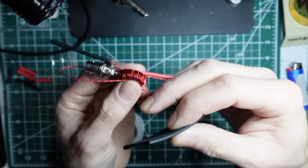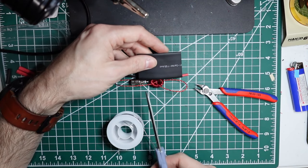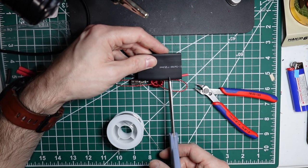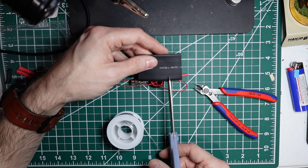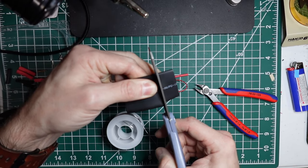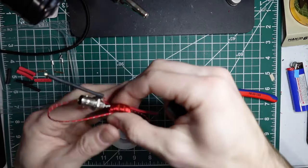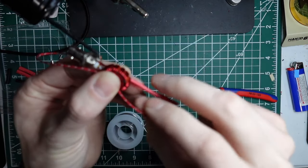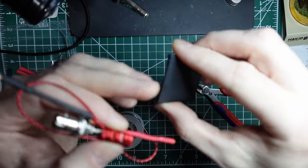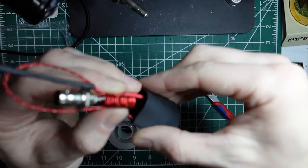And I'm going to trim this side because that's not very straight. What I do is lay it over top, line up one side, and then I'm just eyeballing it, because it really depends on exactly how close your RF connector is to the toroid. I don't want a lot of extra on the end. Okay. And this is complete preference, but there is some marking on the heat shrink tubing. I like to put the marking towards the RF connectors, so that there's one clean, flat area.